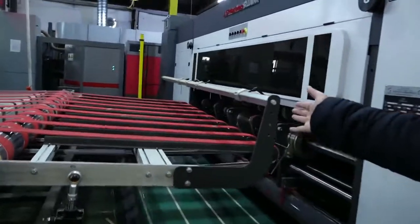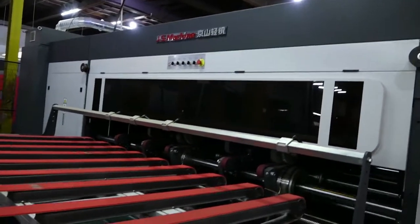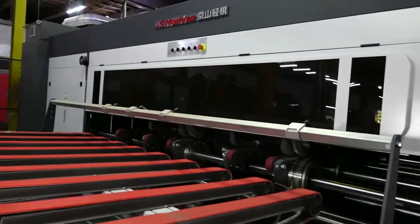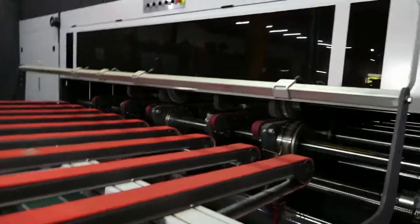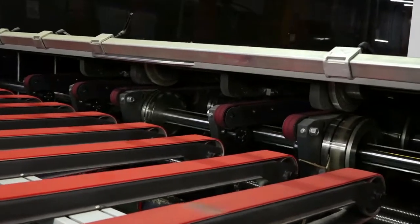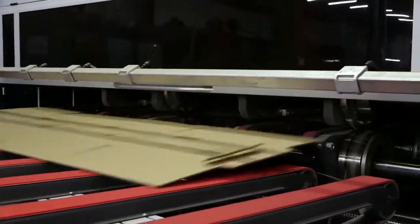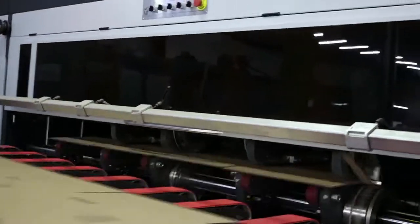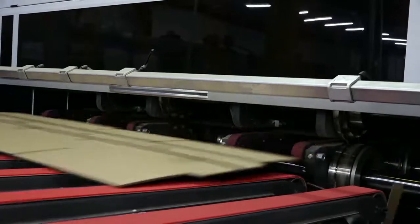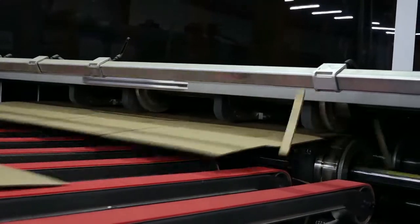Everyone, this is the forming unit. It has a down-shelf slotting structure, making carton height easy to adjust, and optical fiber detects the sheet's leading edge to improve slotting accuracy. According to the order specification, the slotting and creasing adjust automatically. The Slim 2800 can do 2-board cartons with a large size of cover and tray cartons, formed through the knife heads of a full-width screw moving structure. If necessary, extra cutting blades can be added through the screw holes. Now the sheets are passing by.